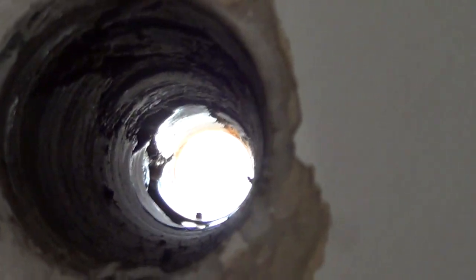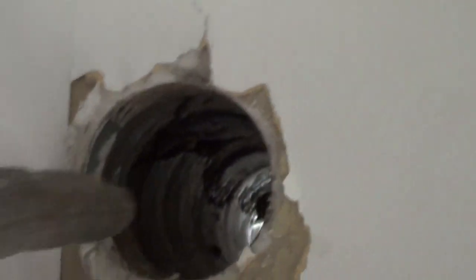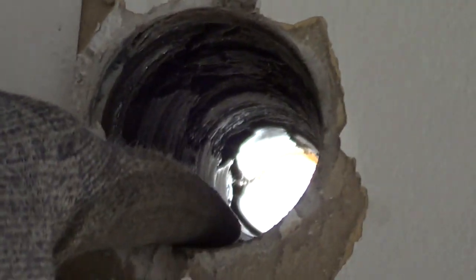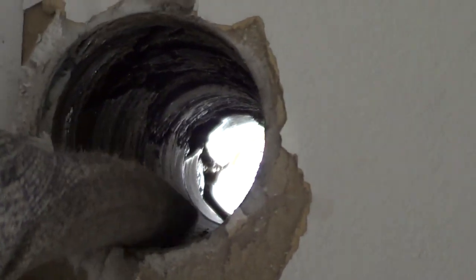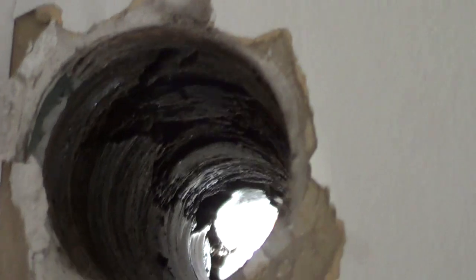No mess in the place because I cut my water before I got to the very end. And there's the hole — two feet of stone. I also pitched it so my wooden jig has a little bit of slope. This is getting a mini-split, and that's a long enough horizontal run where you want to slope it for the drain.